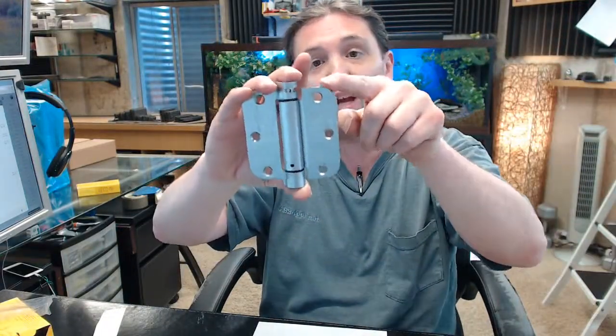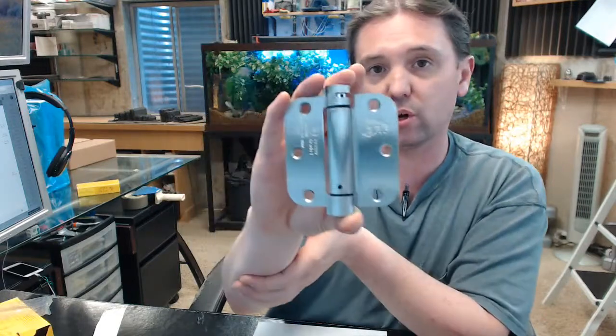The 5/8R is a reference to the 5/8 radius corner. Very typical sort of corner that you're going to see in residential sorts of installations. The reasoning for that is when you have a 5/8 radius, that means you have an 1.25 inch diameter, and that's the size of the router bit that they use when the door manufacturer or the shop, the wood shop, the door shop is routing for these.